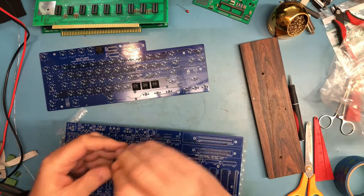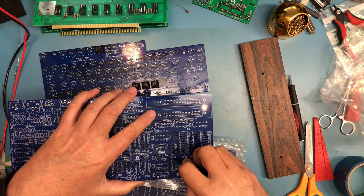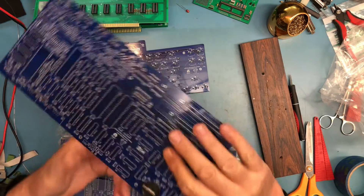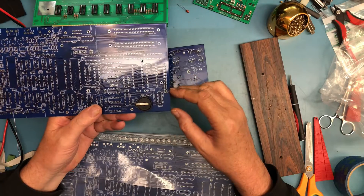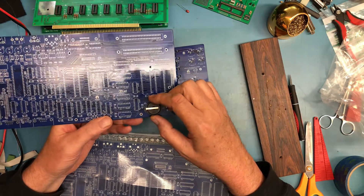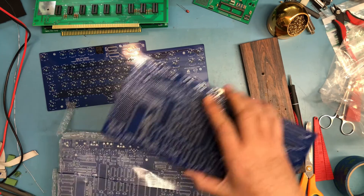I plucked this battery holder hoping it would fit, and it does. So that's a pull battery holder. There was no stock anywhere I looked for the battery holder, so I held on to this thinking it might actually fit — and it does. That's for the real-time clock backup, just a standard CR2032. Happy with that — it'll get captured into the box of fun stuff.